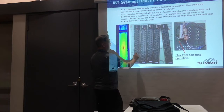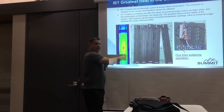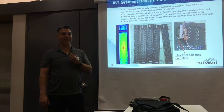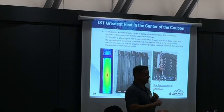The power goes back and forth on the inner layer, you're running current through there creating heat — heating from the inside out. The center is still going to be hotter than the outside because it's just sitting in the room. I've got to tell you how many amps are driving through a microvia — it might be a daisy chain — five amps! I'd like to see any one of you hold a wire with five amps going through it. A five-mil microvia driven with five amps — how long do you think it would last?